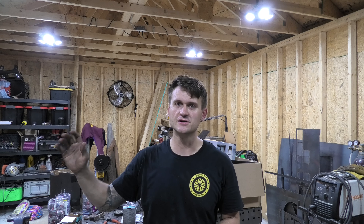We're going to start by running the 115 volt wiring back through the rest of the shop. I already started — I pushed the stuff that was right here over to that wall because that was the light switch and one of the outlets. To do this, I'm going to be running some armored cable — I'm using 12-2 cable. The reason I'm using armored cable and not just loose wire is because the whole front of the shop was wired with armored cable, and it makes sense in a shop where you're throwing things around and doing sparks to protect the cables.